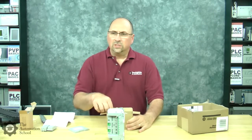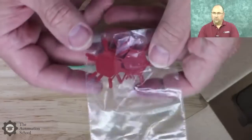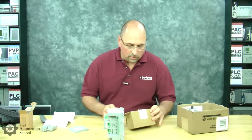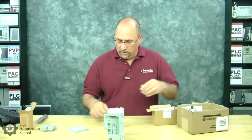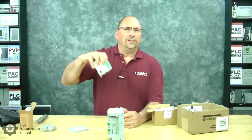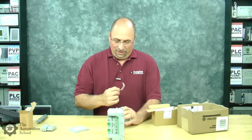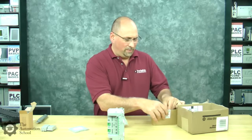It's all pretty common sense. Let's get it out of the box. You always want to take this cover off the top of your PLCs before you power them on, because they need that air flowing through them to cool them down. However, you never want to take them off before you get the thing installed, because you don't want any filings or metal chips to fall into your PLC. You would not believe how many times I've seen people bring in defective PLCs and you just look at them and all kinds of stuff falls out. Communications is key to make sure things like that don't happen.